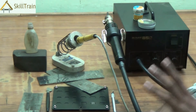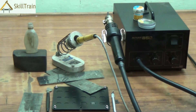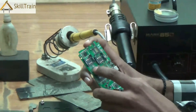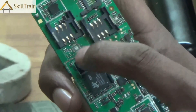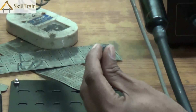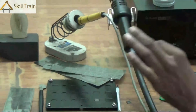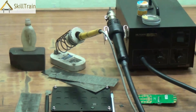It could also be doubtful in that process, because sometimes the IC may not be touching properly. So even in case of doubt, you can try and use this whole process of reballing to remove the IC from the board. Once you remove the IC from the board, you can check the back side to see whether the BGA or the ball grid is in position. If the ball grids are not clear or have ruptured off, you may want to use the reballing process to reball the IC. You will use the entire plate on top to create those ball grid arrays at the back of the IC and replace it back on the PCB. This is the process of reballing.